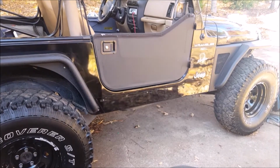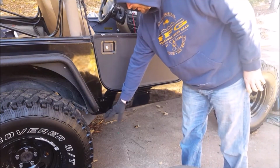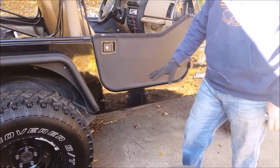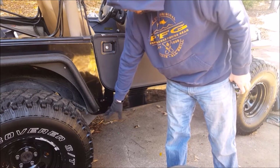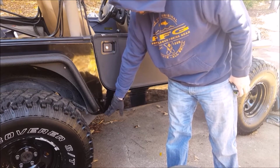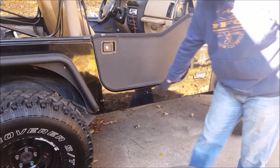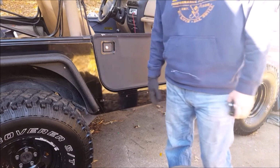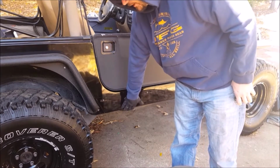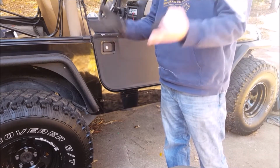So based off the measurements I just took, the bottom edge of the 6-inch piece would be 45.5 inches. There's 2 inches between where I want the top point and the bottom. So that's when I had 2 inches on this side, 2 inches on this side on the top edge. So that's 4 inches, so that'd be 49.5. So top edge 49.5, bottom edge 45.5. Measure that out on the 6-inch piece and get ready to cut my angles.